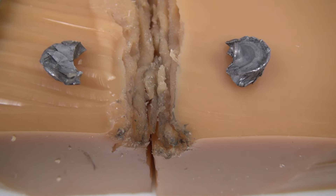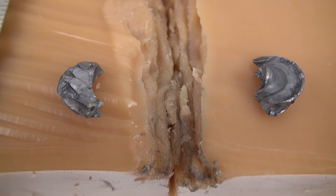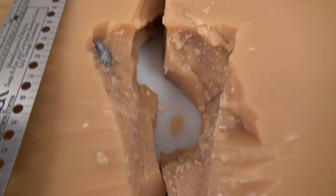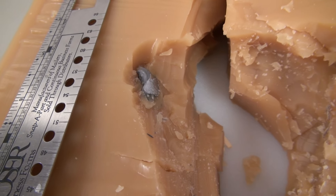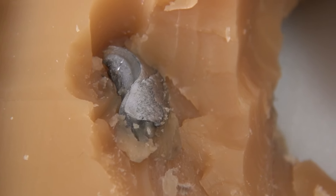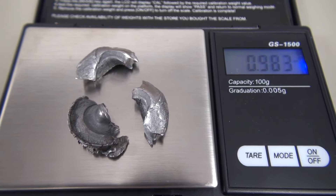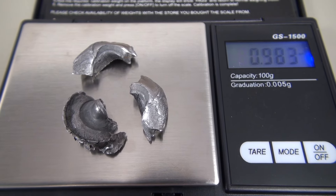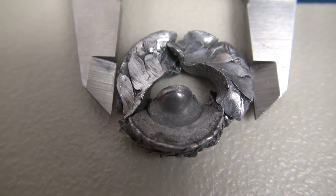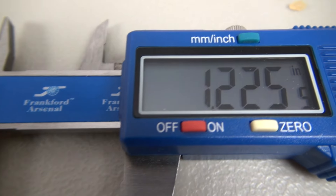Here is another perspective — there are the two halves, or are they? They don't go together, and the weight is coming in at .737 ounces, so something is missing. On the left side of the block in the track, there is another chunk of the slug — so it didn't split into two, it split into three. With all the sections recovered, we're still coming in a little less at .983 ounces. It's odd that two of the three pieces really flattened out. Diameter at that mark is 1.225 inches.